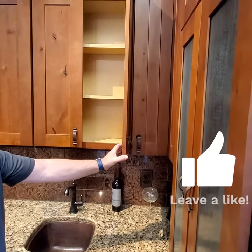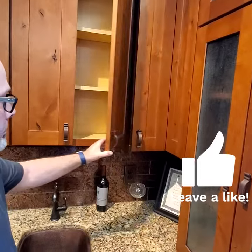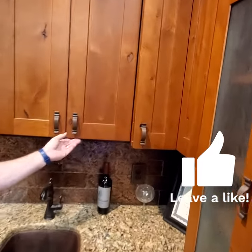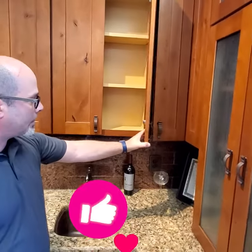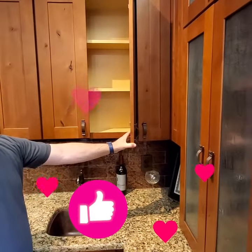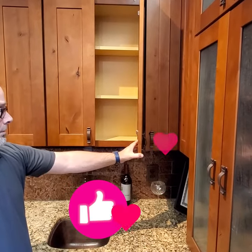When it's open all the way you can see it's hitting the other cabinet. We can put a hinge restrictor inside the hinge, and instead of opening all the way, this door would then stop at 87 degrees — approximately three degrees away from the frame on the adjacent cabinet — so we wouldn't be banging that over and over again.